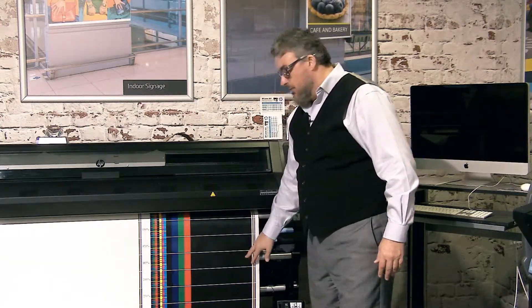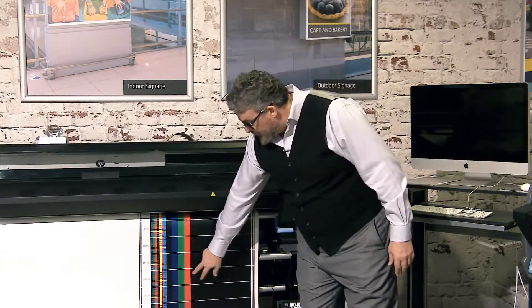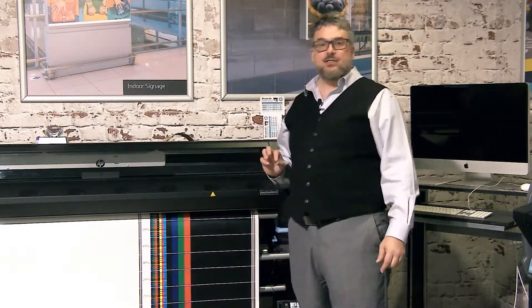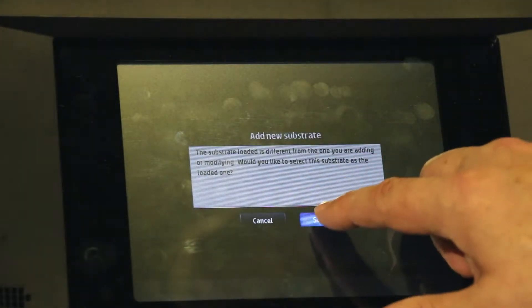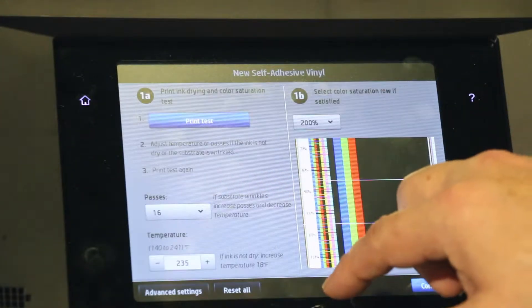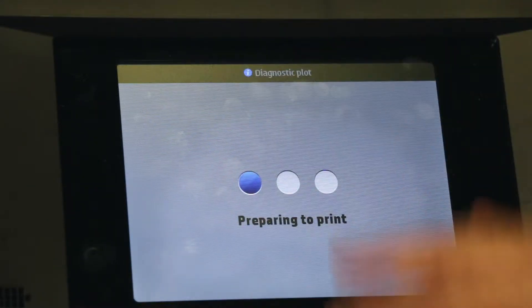This black chart represents maximum density. At 16-pass with no interpass delay at 235 degrees on this particular vinyl, I am able to put down 200% density dry. I'm going to build this with a large ink signature, just like a backlit. Then the next step is to hit color calibrate — which, as an adhesive vinyl selection set as backlit, it will allow you to do. And then lastly, I'm going to create an ICC profile on the 365.